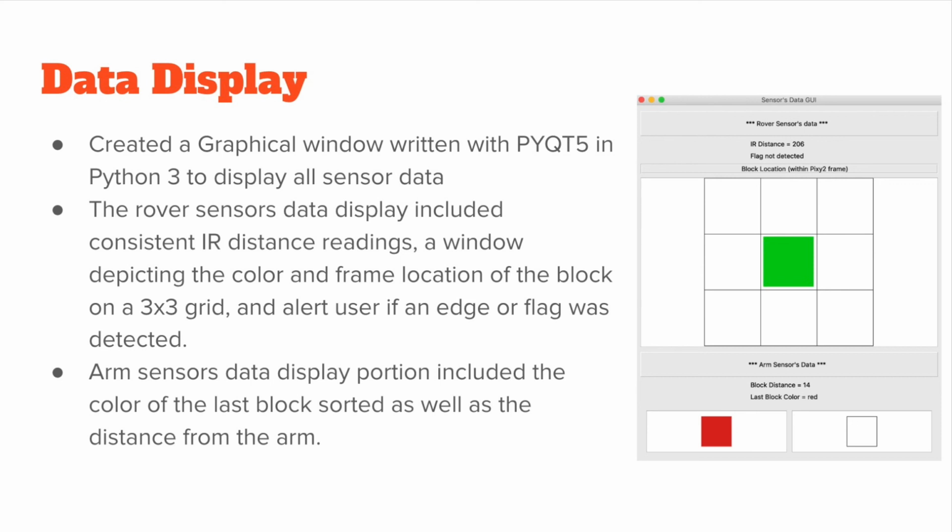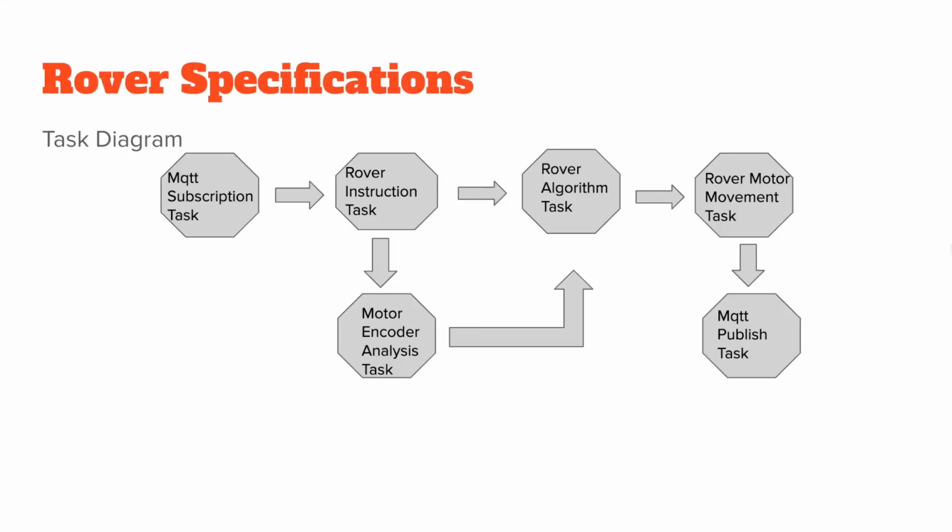The arm sensors displayed the color of the block that dropped through the funnel and how far it is away from the arm. This is a basic diagram of how the rover 2.5 worked internally. It would receive a message in this MQTT subscription task that would be subscribed to a topic that the rover sensors were publishing to. It would then interpret this message as an instruction.